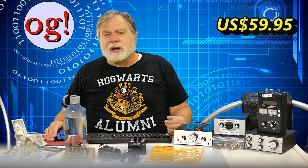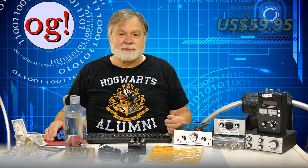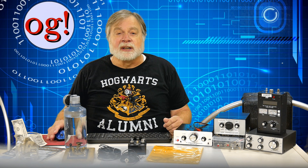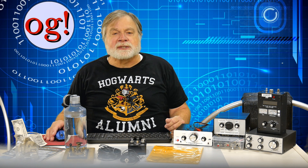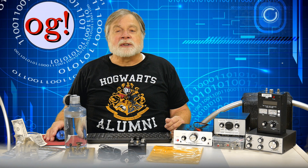The retail price is a penny less than 60 US dollars. Now this is a different type of antenna from those we've looked at recently, and I warn in advance that this is a compromise antenna in that it doesn't radiate or hear as well as a half-wave dipole on the same frequency. Nevertheless, there are use cases where this antenna might be just what you're looking for. This antenna is designed for portable or indoor operating, and the antenna can be strung up in an ad hoc loop even indoors.